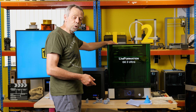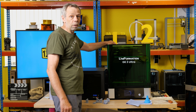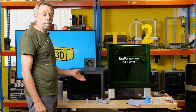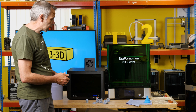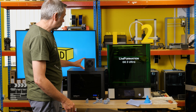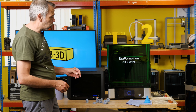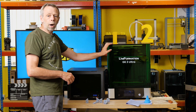We've also got the nice feature where we can allow the build plate to drain resin back into the vat once the print is finished. We have the active carbon filter on the back of the machine. We've had this printed in the studio — it is relatively hot today, if we were going to get any fume issue today would be the day — and we have smelt nothing at all. The curing station also has a charcoal filter on the back to vent any IPA, resin fumes, and whatever else from the baking and curing process. These are two very capable units you could use in your study or workshop, and notably they are incredibly quiet.